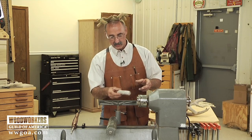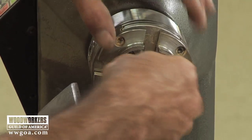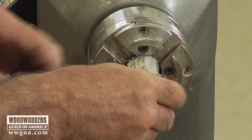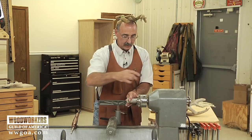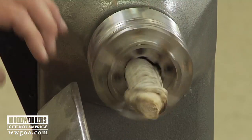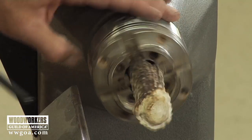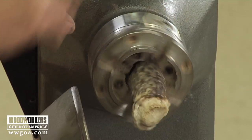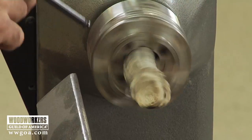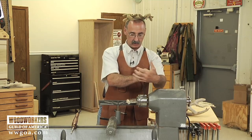As it goes on the lathe, I'll get the antler inside the four-jaw chuck, and what we need to do is mess with it just a little bit to try to get the antler as centered as possible on the lathe. I'm going to tighten her down, then just kind of spin the antler by hand. As I turn this by hand, I'm looking through it at the floor to see if the antler is bouncing around. If the antler looks like it's running pretty straight, then I'm pretty straight on the lathe — so let's go ahead and snug down that four-jaw chuck.